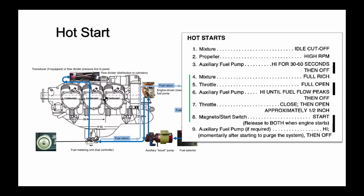After purging the system, perform a normal start. Mixture and throttle controls fully forward — prime the cylinders, although don't over prime. Retard the throttle and then start the engine. When the engine is very hot, there may still be pockets of vapor in the lines. If the engine stumbles or begins to quit following a hot start, run the auxiliary fuel pump on or high momentarily to keep the engine supplied with liquid fuel. When it begins to smooth out, turn the auxiliary fuel pump off.